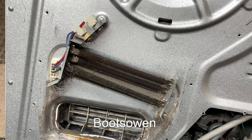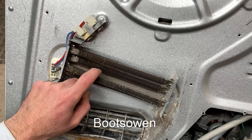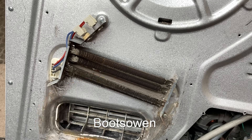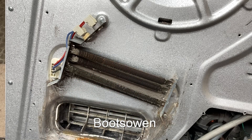DRCS68W — I'm going to Google how much an element costs. I have a feeling they're about 16 quid, which is more than I'd want to pay, so I might be able to affect a repair just using a tiny piece of metal pushed through. Other than that this element is quite clean — there's a little bit of stuff but not a big deal. I suspect it has two sets of elements — high and low — so it has all four on together or two on, to give high and low heat for synthetics versus cottons.